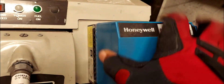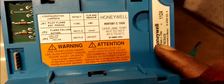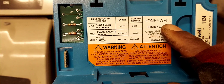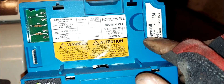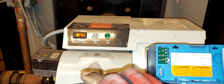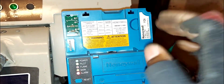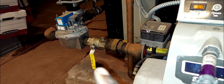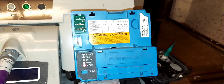We're going to remove this. This right here is the model for the burner controller. There's one screw here and one over there — remove those, pop it off and you can see the information on the back. This right here is not the burner information; it's just the timer card. It's a 60-second timer for this particular setup. This is an interchangeable piece — this is a gas-powered boiler, by the way, though this control can be used on all burner types.